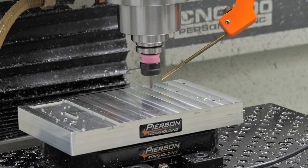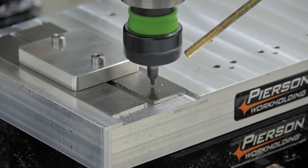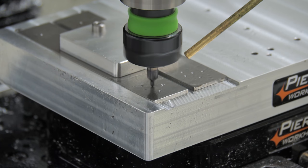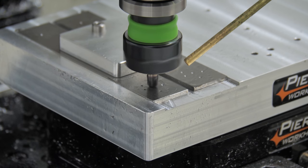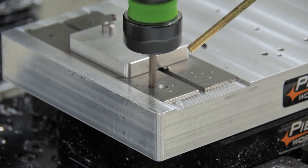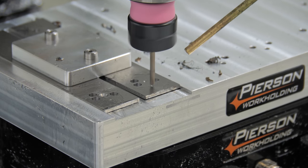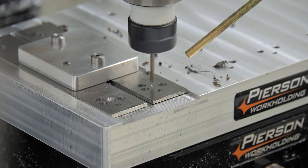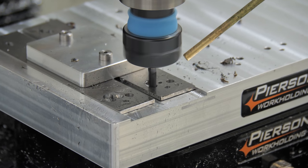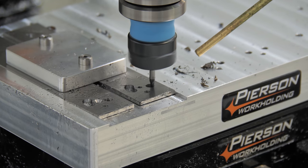I have 3 out of the 5 blade operations on this palette. Now one of my blades has a countersink, so I'm using the same tool to spot drill all the holes, as well as make the hole with the countersink. Getting more use out of one tool means less tool changes. Because I put 3 operations on one palette, each tool isn't doing that much work. I have to do a tool change to drill a single hole. If I had put 8 of the same type of blade and operation together, I'd be drilling 8 holes.